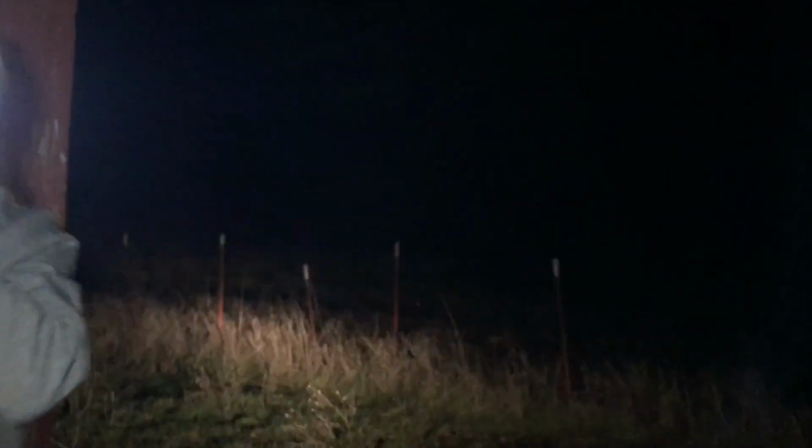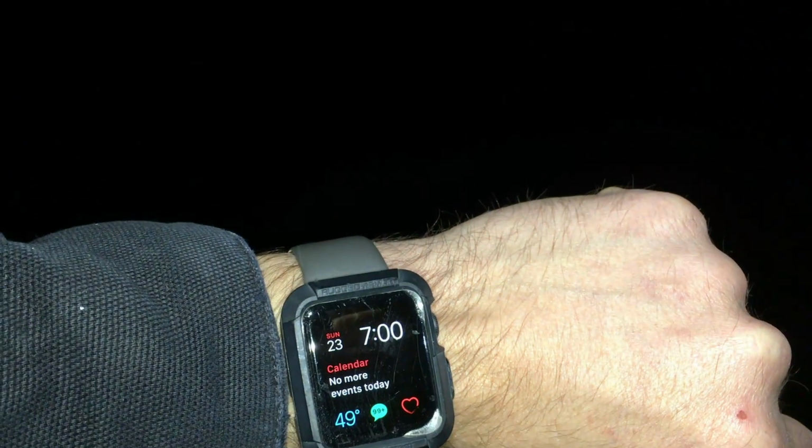Now that we've turned this on, it's pumping, and the pumps are taking about 35-40 minutes, Siri's trying to read what I'm saying. Anyways, it's taking about 30 to 40 minutes per cycle of putting in enough to treat 350 gallons of water at 200 parts per million with the bleach. And so now I'm going to drive up to the mountain that way and tell Tara when to turn it off once I know the level's up.